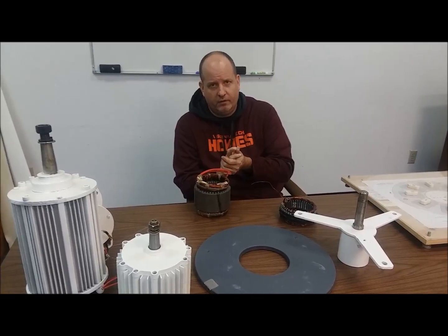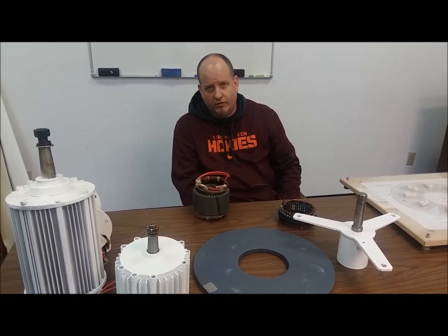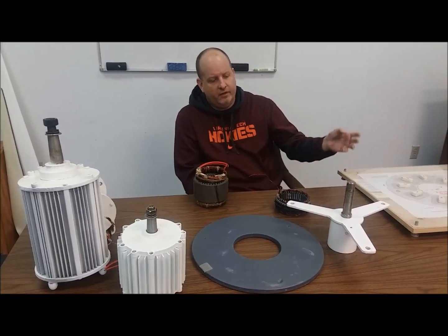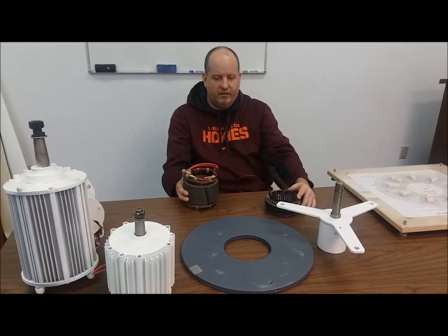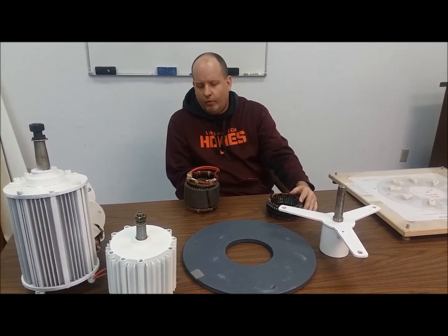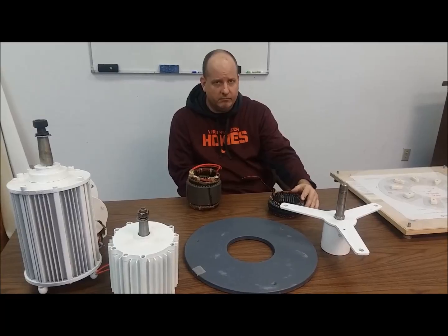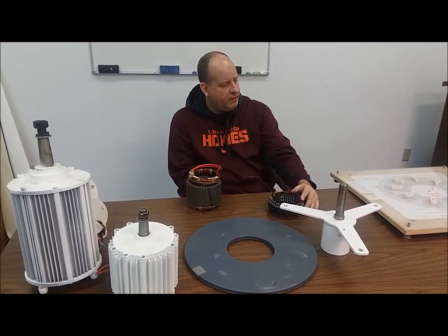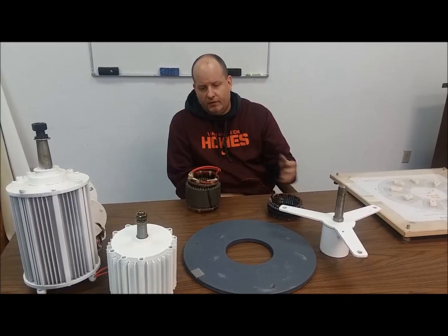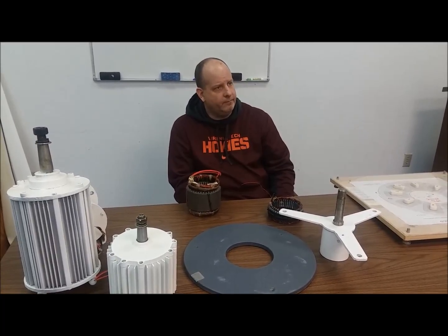To address the point that I didn't talk about wind speed last time: it is all relative to the wind speed. Small blades turn faster, large blades turn slower, but you also have to have torque. If you don't have cut-in RPM and you don't exceed the cut-in voltage — unless you're using a boost controller — you don't get anything. What we like to do when possible is run a higher-voltage stator and use the Midnight Classic controller with a Wind Track mode, which does a very good job of harvesting power and is better for the turbine in terms of control.